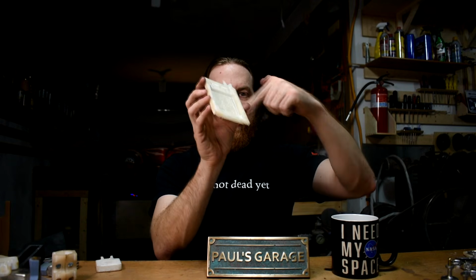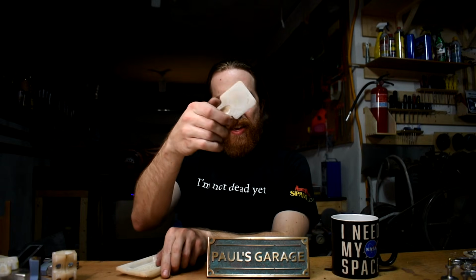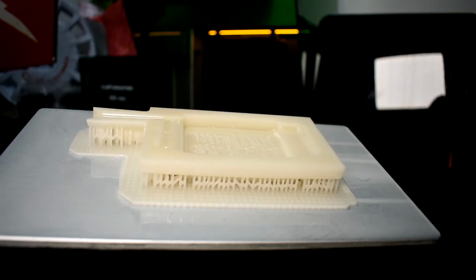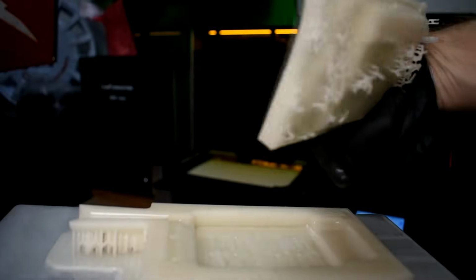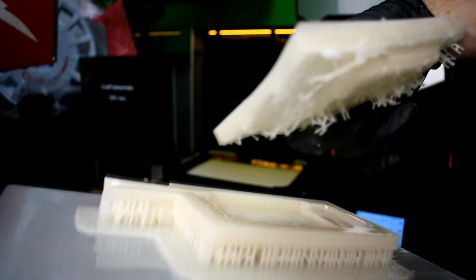Okay, slicing. Arranging the part in the slicer is a little bit different. This is where it's different. I have found if you have a flat surface that has to clamp against something else, like in the case of these or these, it's more important on a larger thing. You want that surface to be one layer, which means that surface should be parallel to the build plate. I know generally they want you to angle stuff. The more I angled stuff, the more print failures I had and the more warped things I had. If the thing warps, it won't seal.